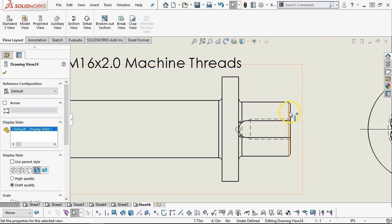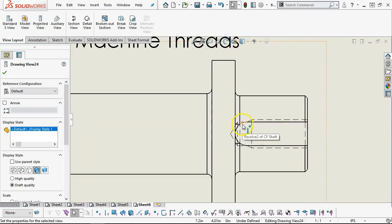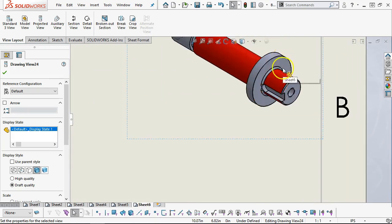The other thing of note is because we have that, again, 4-pound, 2-kilogram cam out there flopping around off center, there is going to be a lot of stress on the nose of this shaft. So one of the things that I put in, it's kind of debatable whether this would be a controlled radius or not. But on the bearing model, it shows that there is an interior chamfer that would clear or not contact this radius. So we've identified those as stress risers, someplace that's going to be taking a lot of load and potentially fail. We're going to leave those 1 millimeter radiuses in place, and you'll have to decide if structurally they need to be a controlled radius or if we can stay with a standard.